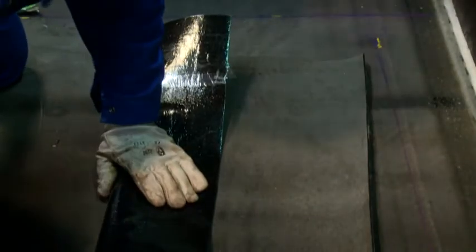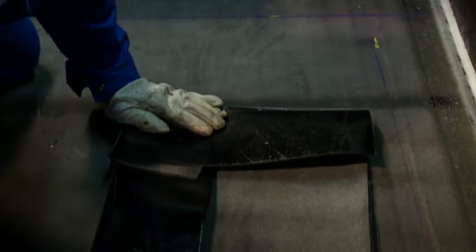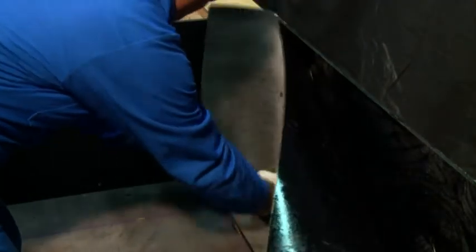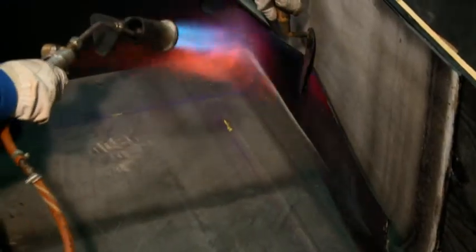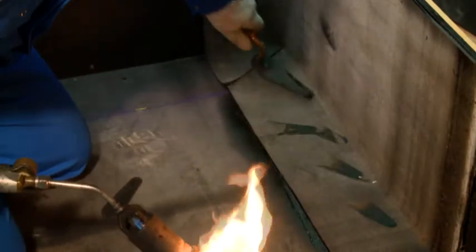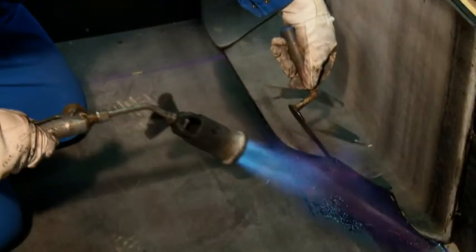Cut the strip so that the membrane can be placed in the corner. When fixed, the horizontal section should be a minimum of 15 cm from the upstand. Cut at a 45-degree angle to shape a 3-dimensional square angle. Place the shaped piece in the desired angle. Start by welding the vertical and then move on to the horizontal. Finish the details by ironing out with a trowel, ensuring that the under-facing film is melted for subsequent fusing of the surfaces.